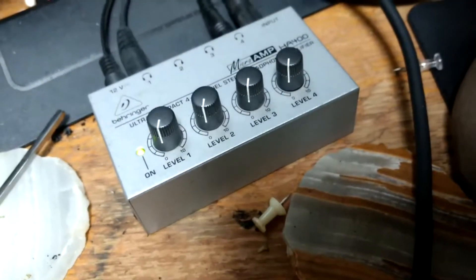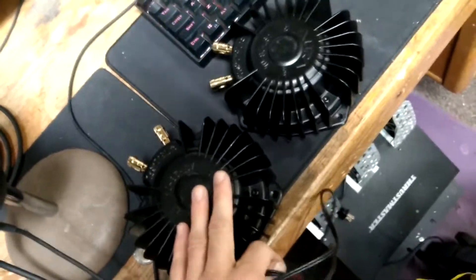A couple of things I want to mention. I would normally be using this headphone amplifier, which is plugged into my Tascam US-1800 — that's the headphone output — which is plugged in by USB to my computer. This headphone output is already a boosted signal; it's meant to run high-end studio headphones, so it has more power than your average auxiliary output on your computer. It's already going to be a somewhat boosted signal, but it's probably still only about one watt of amplification — it's only a preamp.